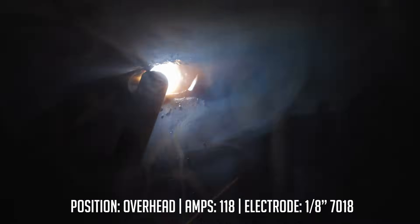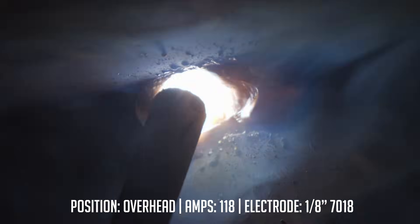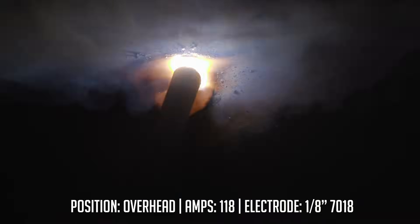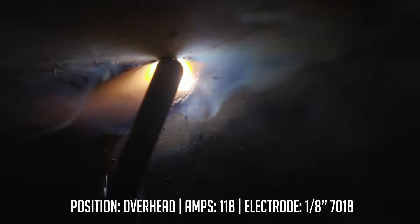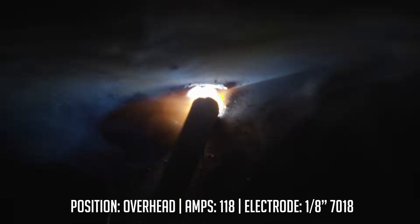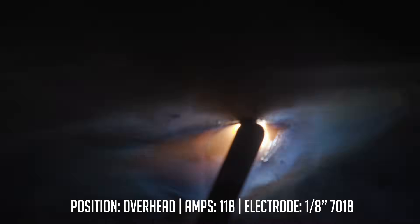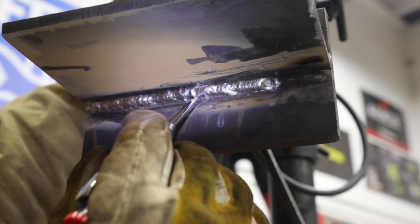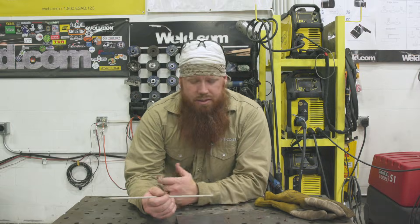Now I've got that nice little crater in there. I'll start right at the edge of that crater — probably about a quarter inch in front of it — strike there and whip back to it, then wait till it ties in and just move forward. The biggest problem a lot of people make is they don't go back far enough, or they go back too far. Too far and you'll get a lap and a real thick spot; not far enough and you'll have a separation between the two welds. I typically recommend bracing yourself, maybe using two hands, striking off, then getting that hand out of the way. Tied in pretty good — no big lump, no big separation, a very smooth uniform transition, which is exactly what I'm looking for.